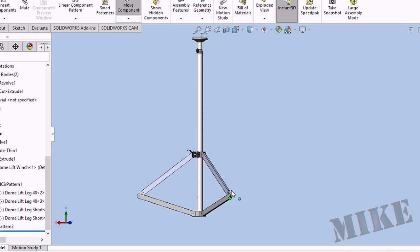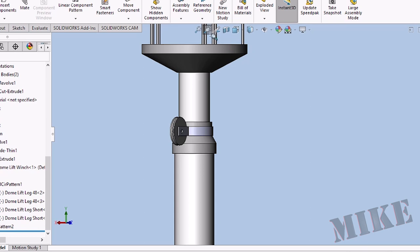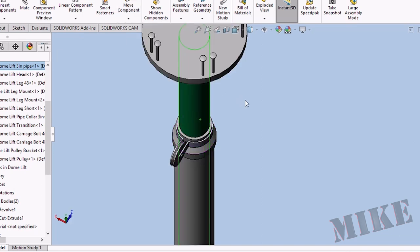This is what we came up with. Tyler and I thought about this for a while, and we came up with this telescoping pipe that's going to allow us to build the dome from the top down or disassemble it from the bottom up. It's got a 4-inch and a 3-inch PVC pipe nested together so that they telescope. The dome's only 16 feet tall, so we're good.